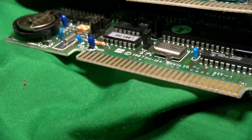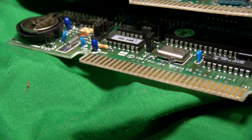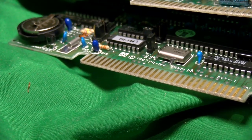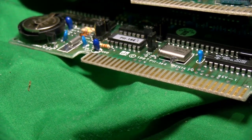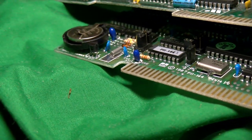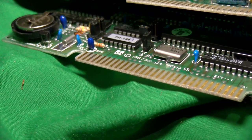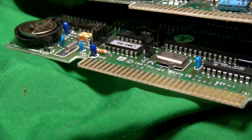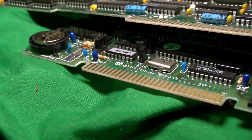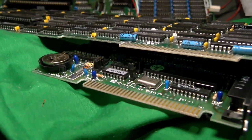One thing you really do want to be mindful of with 8-bit cards, I mean, this RTC one not so much, because I can't think of any 16-bit machines you'd put this into, but, well, it is a 16-bit machine, I mean, 16-bit ISA. But still, some other cards, video cards, all sorts, they protrude into that space you can see over there. You won't fit this in a 16-bit slot. It doesn't matter with this particular card, but obviously that ain't good. Could be a problem. It's fine in here, only 8-bit slots. It just barely fits over the top of where the ICs are. Something to think of, and some cards even did leave cutouts for it, as you can see with that one there. But some of them don't.